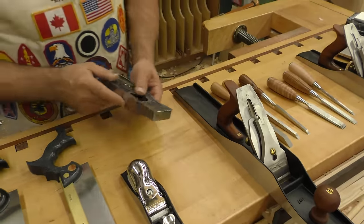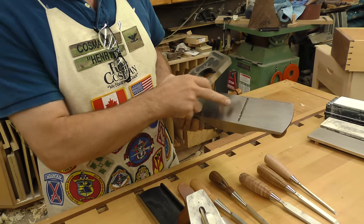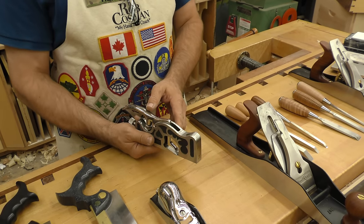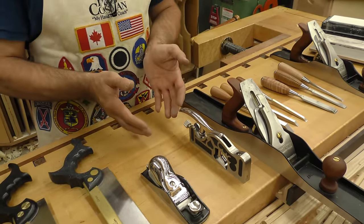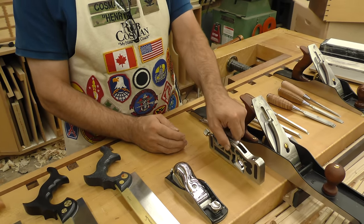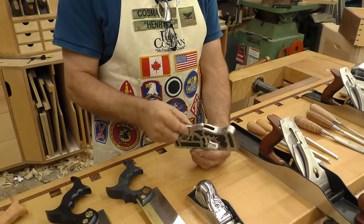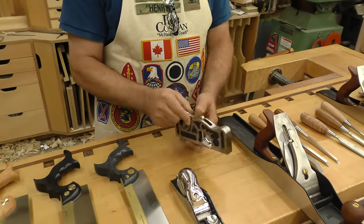Next is going to be a shoulder plane. This is a must-have because it will do something that none of the other planes will do. If you look at any bench plane, the blade does not go to either side — it stops short. If you're going to adjust the shoulder on a tenon, you have to be able to work right into the vertical surface, and that's allowed with a shoulder plane. This is a three-quarter, and it'll cover almost any task you're going to have building furniture. When they designed this, they patterned it after an old Preston, and the lever cap is hollowed out on the underside, which allows you to put your fingers underneath and squeeze it for lots of control. The lever cap is also down low, so you're really behind the blade instead of sitting up on top of it.